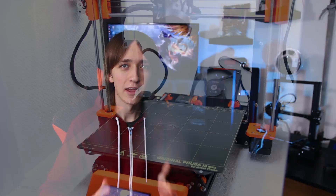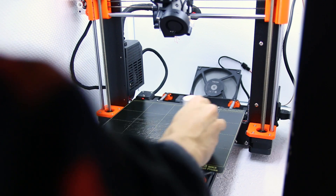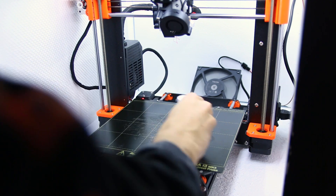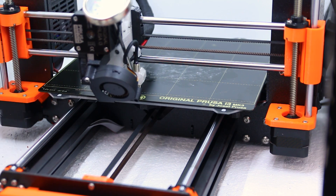PEI — it's just gonna rub over it. I tried printing on a better PEI sheet, even heated up to 120 degrees Celsius, the maximum that the Prusa can go stock, and even though it was pushing the material onto the build plate, it didn't stick in the slightest. The only thing it sticks very well to is itself. I decided to try a glue stick, which works okay — it doesn't stick perfectly but it holds down. If you make sure that your first layer gets down very close to the build plate, just the perfect first layer, and you make sure that the nozzle is nice and clean, you can get a good first layer down that's gonna allow you to get a successful print.